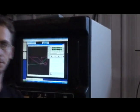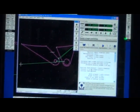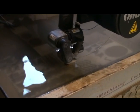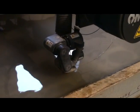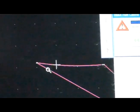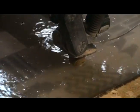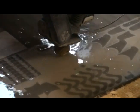Here's Jeremy back on the water jet. There are the parts he's going to be cutting out — those are the hinge brackets so that the nose can tilt. He's going to fire it up for us. Jeremy's going to raise the water level, which keeps the noise and the dust down. He's going to cut out the brackets. Here you can see how fast the water jet cuts — follow that cursor cutting through 1 and 1/8 inch stainless plate. And there's our parts.